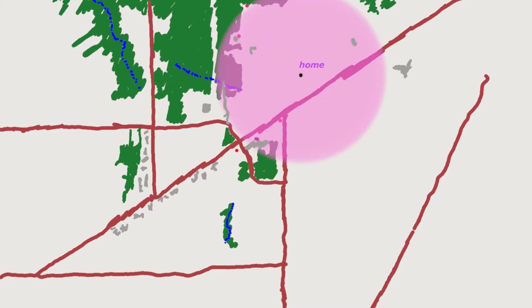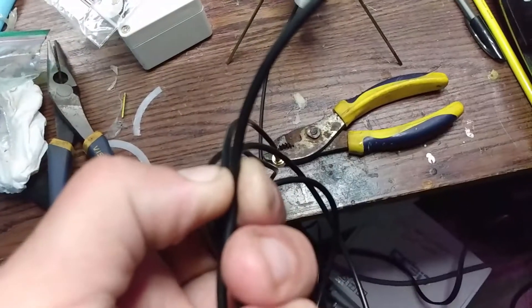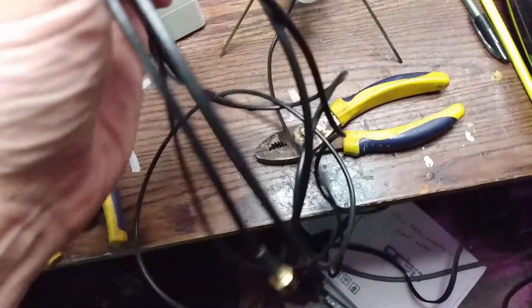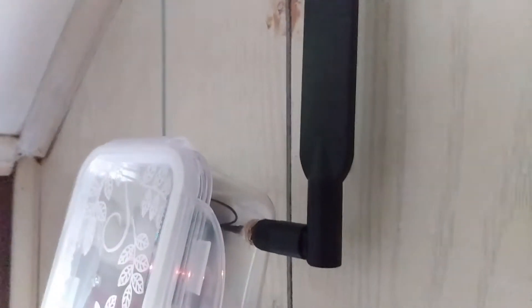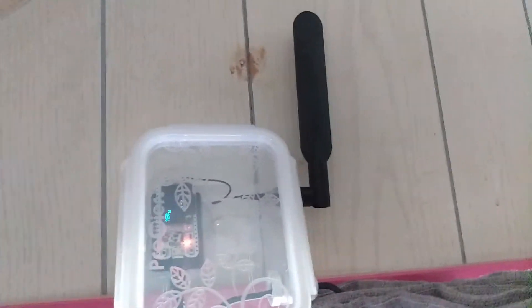With that being said, the tuning of the antenna is rather important. With no real improvements and nothing but losses to show, I did a little more research. I realized that with the cheap, thin cable I'm using, I'm probably losing more signal than I'm gaining. So I'm going to try and directly connect the antenna to my device, which should improve any losses that had occurred.